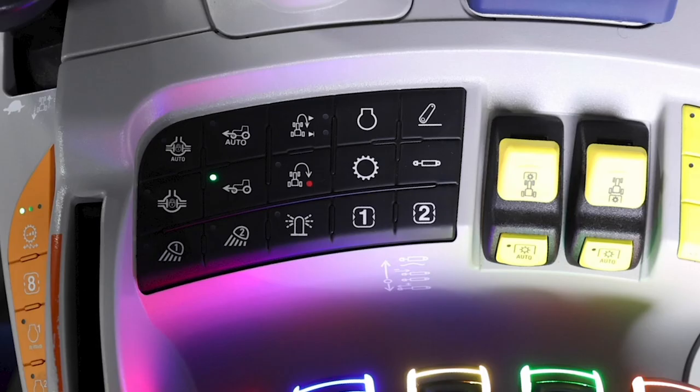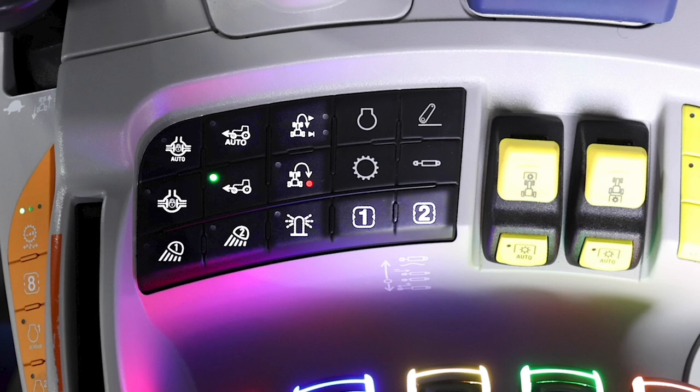The main button pad has key functions ergonomically located close to the operator: auto diff lock setting, manual diff lock, 2 memory light functions, manual MFD, auto MFD settings, headland turn sequence record button, beacons, 2 configurable buttons that the operator can customize, shortcut keys, which include engine, transmission, hydraulic remotes, and linkage. These buttons will provide quick access to the IntelliView 12 display so you can make setting adjustments.